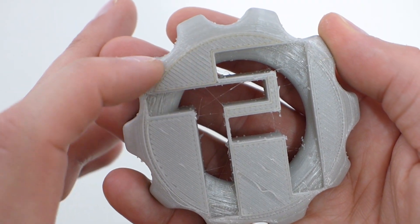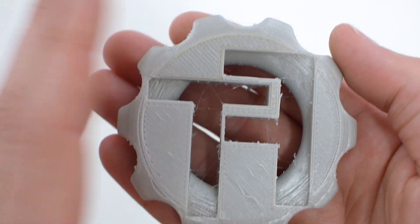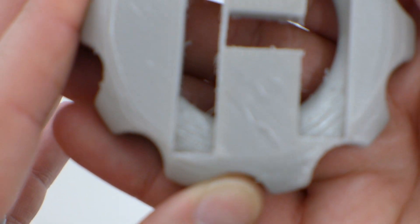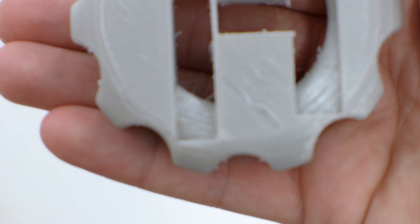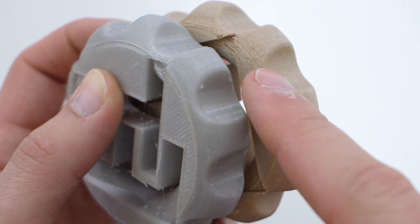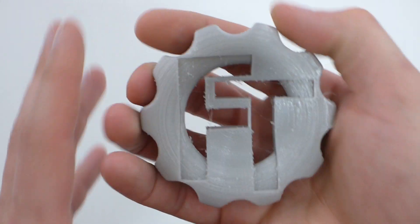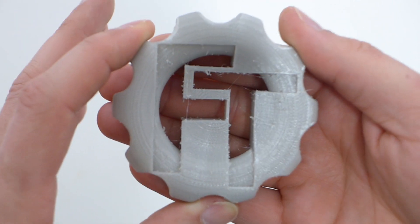The normal MakerCoin with PLA or PETG takes not even two hours — this one took over seven hours. Bottom layers were okay; I was a little far away apparently. A few of the outer perimeter strings actually pulled right off, which is something I need to be careful about. Now, if you look here, there's no support used with this NinjaFlex, because flexible material will fuse to itself just like it would if it was a regular print, even with support regardless of settings. So I printed this without any support whatsoever, and even these walls here came out better than they do with standard PLA. The NinjaFlex behaved very, very well — I'm very impressed. I would love to get more of this to print with and learn more, but this is exactly why I buy the MakerBox every month — to learn how to print with different materials.